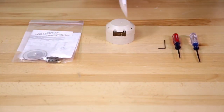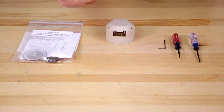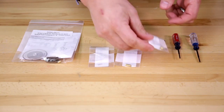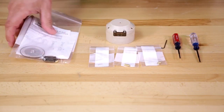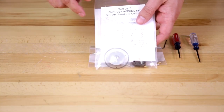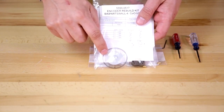For this repair, we're going to use the 5550-0516 repair kit. That includes one pivot, one long jewel bearing, and one short bearing. The only difference between that kit and the 5550-0517 encoder kit is that kit also includes the module and the encoder wheel itself.